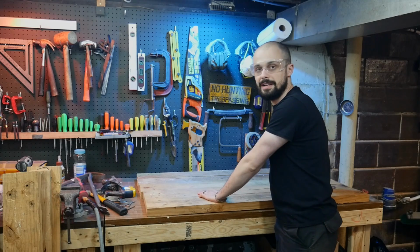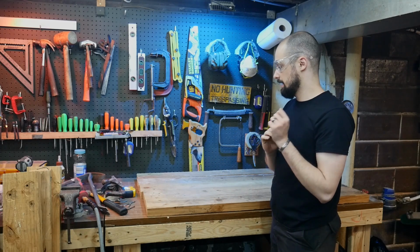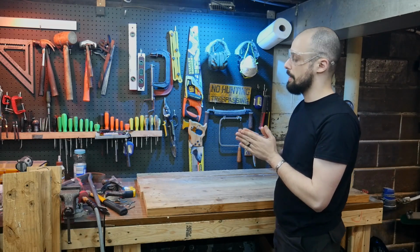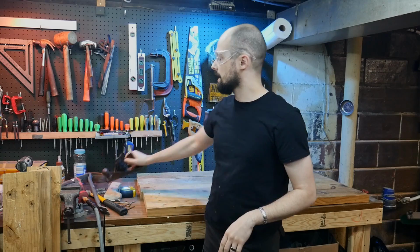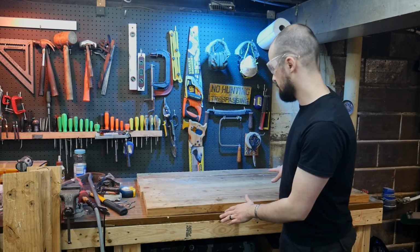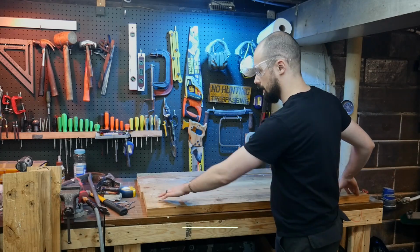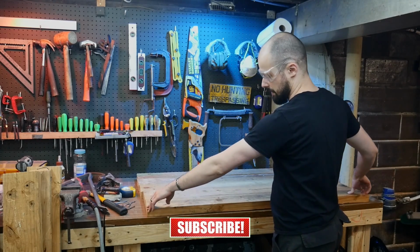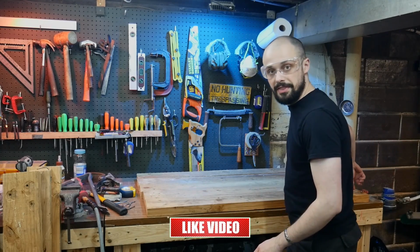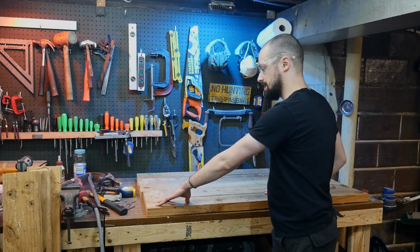Now it'd be nice to have some fancy equipment to try to make everything perfect. I have something that possibly would work for that, but I'm going to try to do it all by hand, using a hand planer or a sander. So I have a flat surface. My thought on this, if it all works, is I'm going to track the high points. Like I know the high point is right here on this one, but then on the opposite corner is high as well. So maybe I have to plane down that and try to take some of the warp out of it.